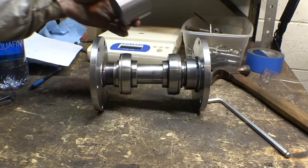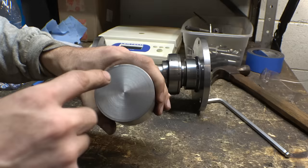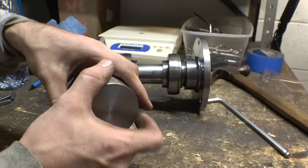Final piece of this puzzle. Let's start working on machining the hub that's going to be carrying the sprocket. That's going to go in the center of this. Basically the same as the previous hubs we've built for this project. We got a bore, an inch and a half hole in this. Machine four keyways. Weld this piece of plate on here. Machine it to size. Drill the holes. And then this thing is pretty much done.